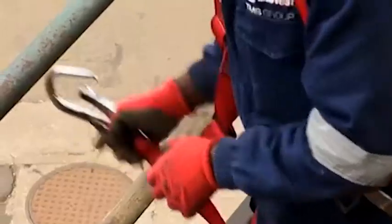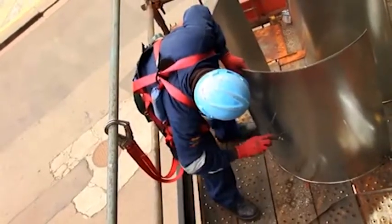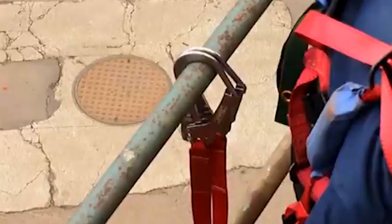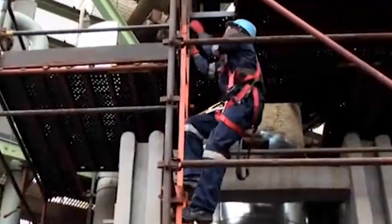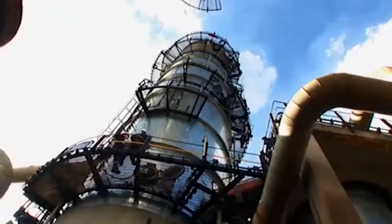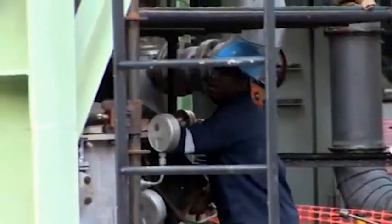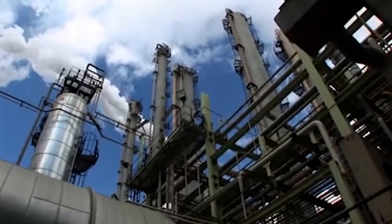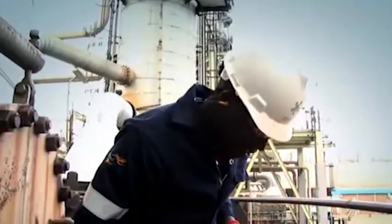The use of fall arrest equipment is also required when working on or near unprotected sides, leading edges, holes, formwork or reinforcing steel, above dangerous equipment and excavations that may be obscured by structures or plant growth. Users of fall arrest equipment must ensure that it is inspected by a competent person on a weekly basis.